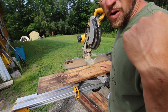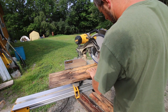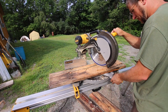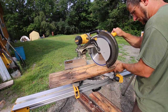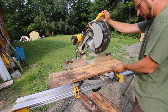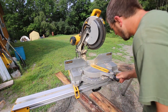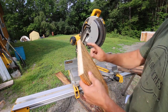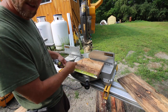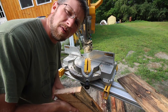I put this board up on the overhang and just traced the angle of the roof. Now we just have to figure out what degree it is. It is 28 degrees. To figure out the length of our next one, the short point is just going to be 13 inches, and we can just keep growing it from there. We don't need to keep taking measurements — we'll try this one first and if we like it, we know 13 is the right number.